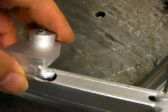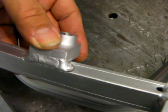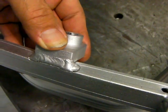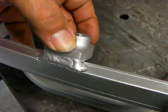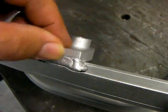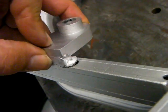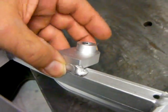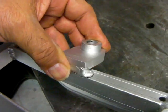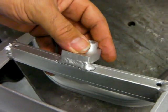I've got to leave all that mess on there so I have something to line it up with, because the main thing is that it fits back on what it came off of. You can see why this thing might have broken — they didn't wrap the corners much and it didn't bite into that thin wall tubing. They had a big heavy chunk of aluminum with only about 30 thousandths wall tubing, so they barely nipped it, it sat there in a bind, vibrated, and eventually just popped loose.